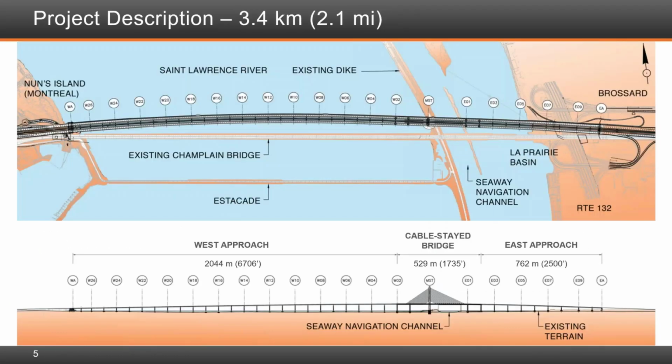Yeah, so my understanding is it didn't add a significant difference because of the large radius, but maybe Marwan, you can. No, that goes to show you that when you have a curve of this nature, gentle like that, it is insignificant. The kink is taken in the connections, and you don't see it in fabrication. You don't camber for fabrication. It's really very, very minor. So okay, there was no impact to the overall cost, if you will.